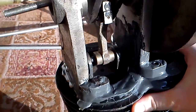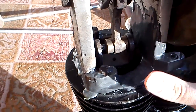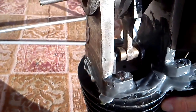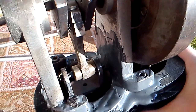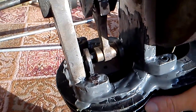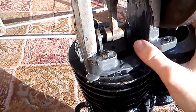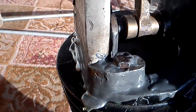I went through trying HTS 2000 in my other videos. It didn't do so well — I think because the aluminum was such a heat sink and the propane torch was kind of weak. So it didn't do its job. So I went with JB Weld. My boss at work suggested it — he's in Canada — and said yeah, that fixes a lot of stuff. So that's what I used.